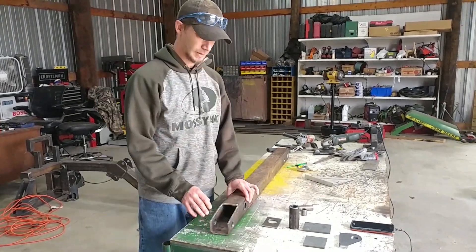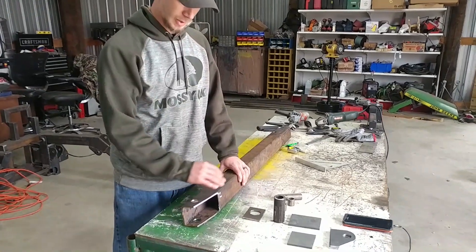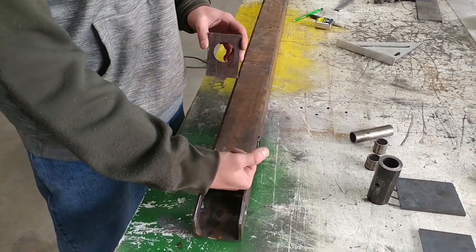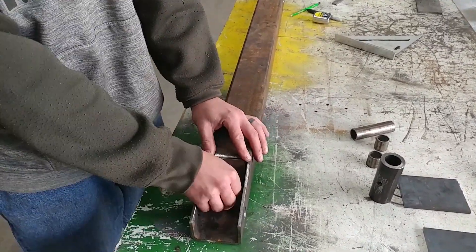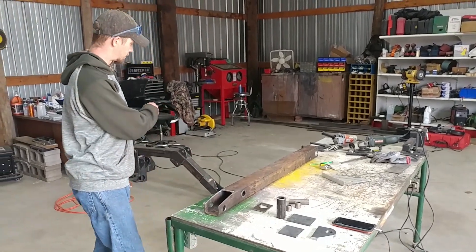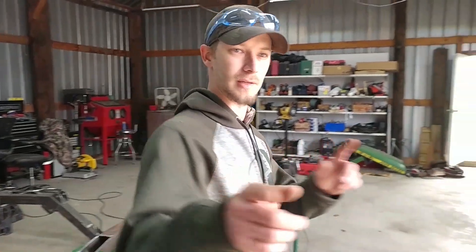We got this piece cut out — here's what it looks like. We cut the little middle piece out, cut our angle on it nice and flat. This is the leftover metal from the top piece, with a hole drilled in it so we can get the grease fitting to run the bushing. It's a little small but it's there to help block it so you can get in for the grease. We're going to tack everything up, throw it on to make sure our bushings line up, and if everything's good, do a full weld and be done.